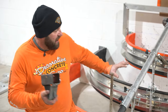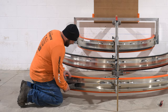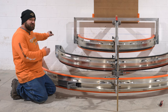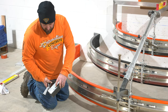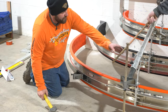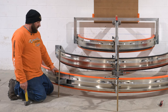The pinlock brackets are optional, but this is when you could use them — if you weren't getting a good bite into the house or you want to put a little extra support somewhere. You just push this in here. Unless you're trying to hold it against the house so it's not pulling out, you don't even really need to use the holes that are in it. Just by wedging that in there and putting another pin in, if I would have driven this into the ground it wouldn't have moved — but that holds it to height.